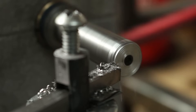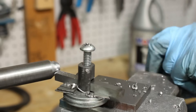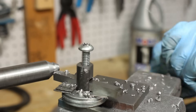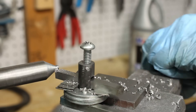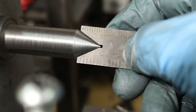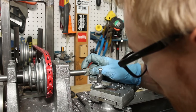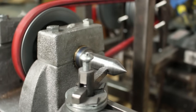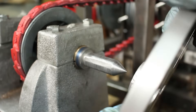I made these spindles a little bit long so there are some ends that need to be faced off. Then on this particular spindle, I tapered down the end to form the point of a center, so now I can turn on centers with this permanent spindle. The faceplate was a little tight on this spindle, so I tried some sandpaper initially, but ended up turning off just a hair, and then some more sandpaper until I got a good fit.